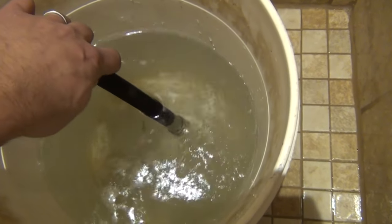Sometimes it's difficult to see the air just coming out of the hose end, but when you have it in a bucket like this you'll know when you're done. The way this feed valve works — right now in normal operating position it's putting in 12 psi. If we want to do a fast fill we push this lever past the notch all the way over and now you're introducing full city pressure into the system. I recommend doing that for a little bit to help push all the air out — just make sure you put that lever back before you close this valve off.